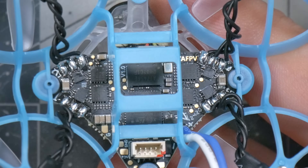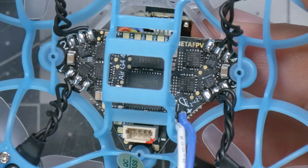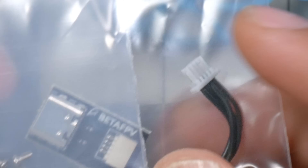I'm happy that the motors are direct soldered to the flight controller. Connectors make it easier to change motors if you damage them, but they suck up a little bit of the energy you're trying to send to the motors. You may have noticed that this flight controller doesn't have a USB connector. Rather, it has a proprietary plug and it comes with a USB extension cable. I can't decide if this is brilliant or annoying — they're obviously saving weight by not putting a full USB connector on. It's going to annoy me the day I need to plug in and don't have that connector with me, so keep it with you and don't lose it.